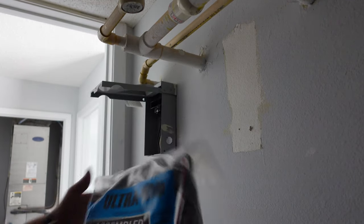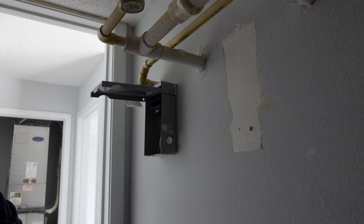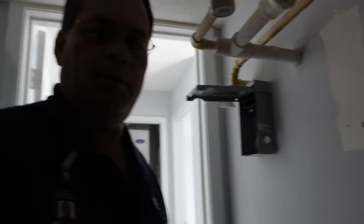Here's my six-foot whip. Now what you need to remember: when you're dealing with a water heater that's using 30 to 40 amps, you want to try to use number 10, 10-2 wire. If you were down at a 20-amp water heater, you could go with a 12, but to play it safe, go with a 10. And that's what I've got here - a 10-2 wire.